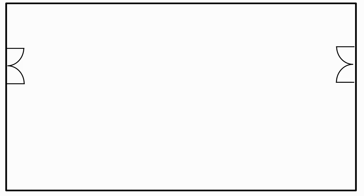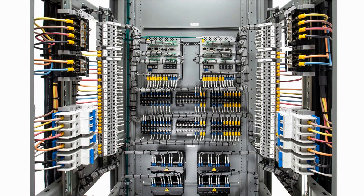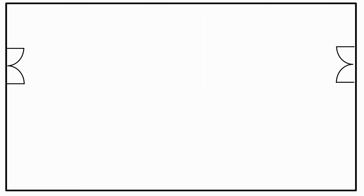How do we locate the panels inside the room? Well, most control and relay panels need front and rear access. The front of the panel normally has a glass door which allows the operators to read all of the relay flags and indications. We need to access the rear of the panel to get access to the internal wires and terminals and also the cables that are entering the panel. We therefore position the panels at least 1.5m from the wall, which allows us to open the panel door and work freely inside the panel.